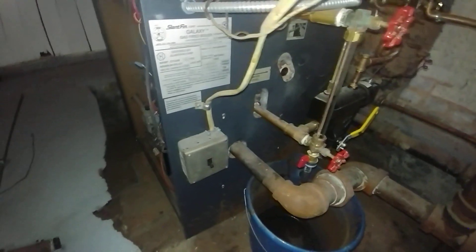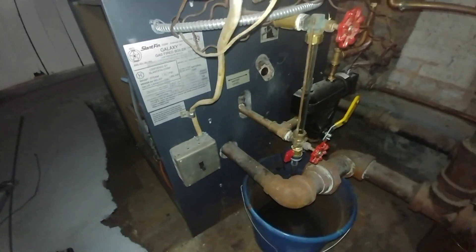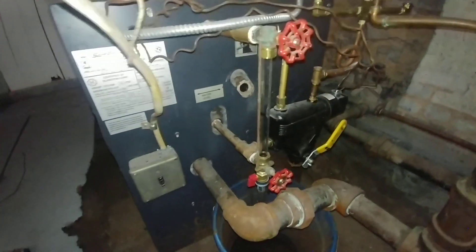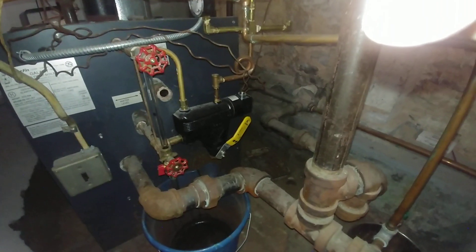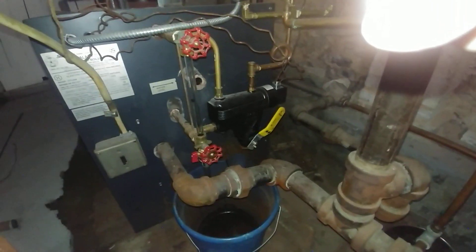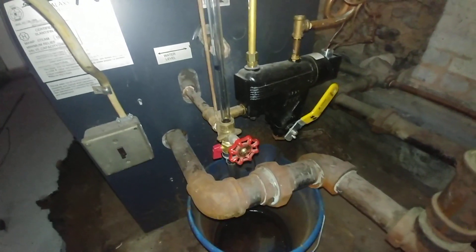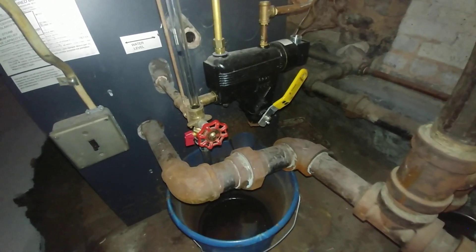I think we also down-fired this boiler to control it, because there's just too much energy being pumped into it to adequately get dry steam out, and that may be part of the issue. There's only so much we can do with what's here. This is why I go through all the steps that I do when I install these Slant Fin Galaxies — because I'm confronted by other people's shortcuts, and I try not to do that to other people moving forward.